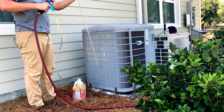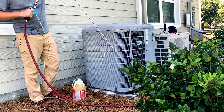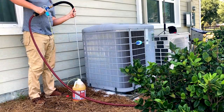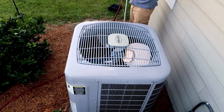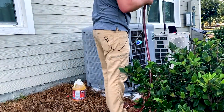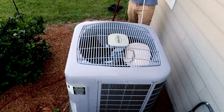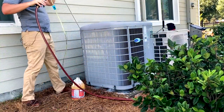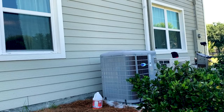With this I'm just foaming it — it's okay to add a little foam from the outside like this, but it's definitely not enough pressure to force contaminants inside the coil, especially with my really poor water pressure. Now that it's well foamed, I'm going to let it sit for five minutes or so and just let the foaming cleaner dwell, then we'll come back and rinse it.